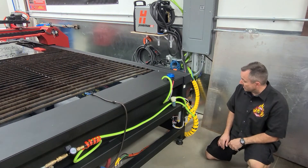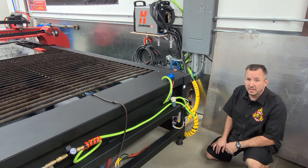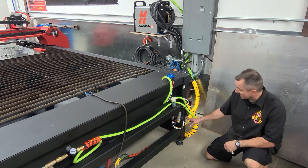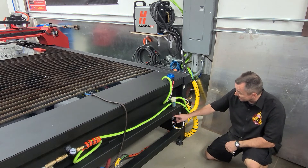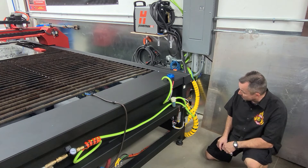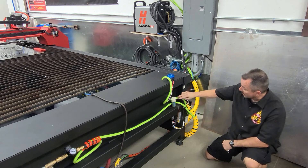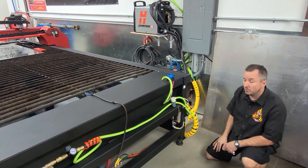Here's the back of the table where I have the pump system set up. Right here is a 12-volt pump — just tiny, like you'd have in an RV, on the smaller end. I also got that from Amazon. It doesn't have to be high volume or high pressure; it's just enough to rinse off pieces. Since it's 12-volt, I have a little adapter that converts AC power over to DC. This hose here leads into the fluid reservoir of the table, comes down through a little filter and screen before it goes into the pump, and then the line goes down to the table.